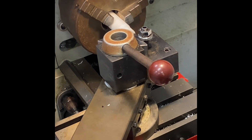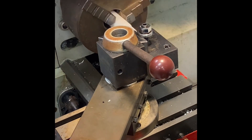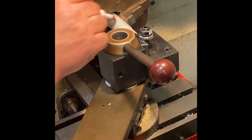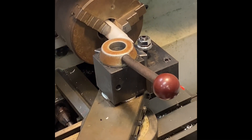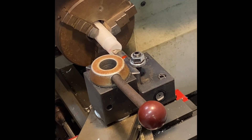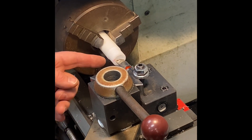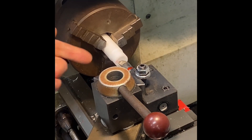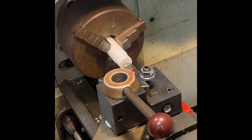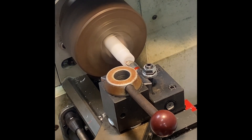I'm also going to pay attention to the depth. Since I'm already kind of there, I can observe where I'm at. Remember, we're blind here, so I can make a mark on my boring bar to let me know when I'm getting close to the backside and close to the depth. Just like the way we touch off on the OD, we're going to come in and touch off on the ID as well. I need to turn my RPM back up to 1100 RPM and touch off here.